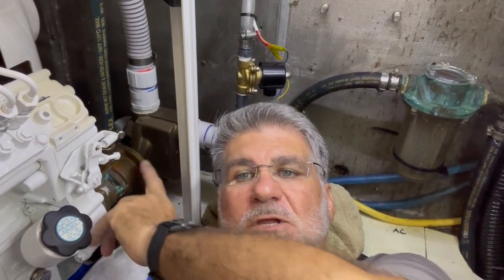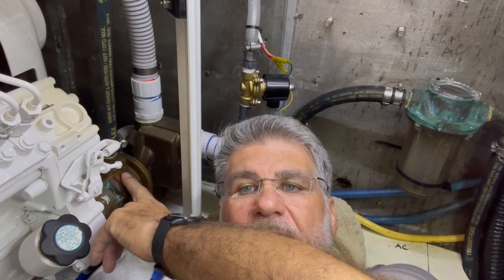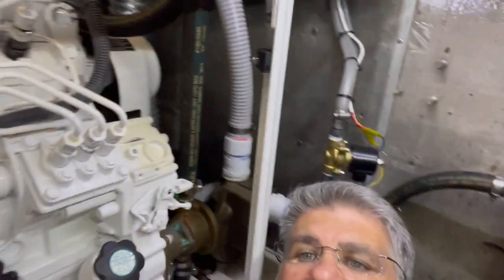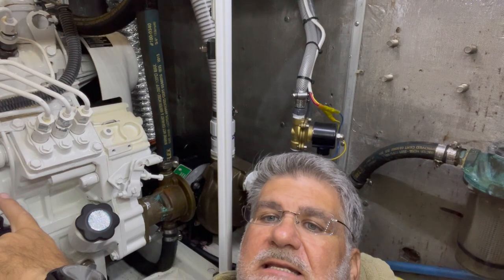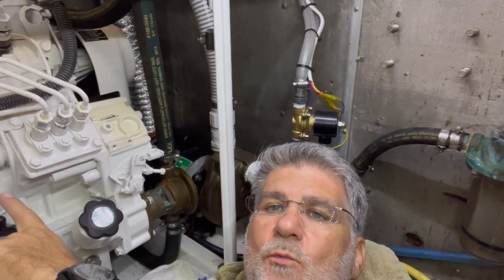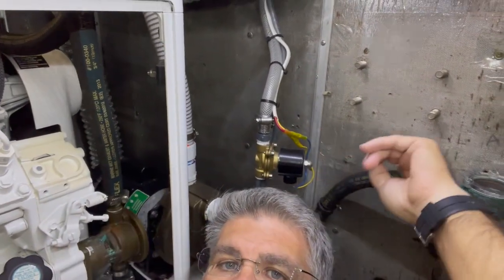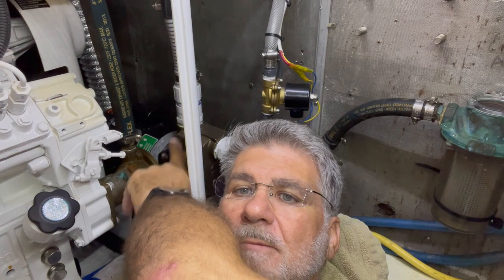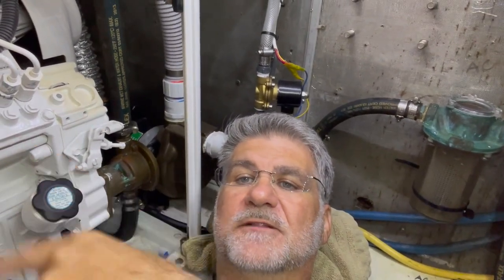In a previous video you saw me rebuild one of the ones I had as a spare, and I wanted to make a note about those spare pumps. The reason I had so many is this is a newer generator — I installed it in 2018, but from 1989 when the boat was new until it was replaced in 2018, the old generator's pump was so close to the bulkhead that there wasn't enough room to get a tool in to pull the impeller. So every time I needed to change the impeller, I just changed the pump. I kept two pumps and kept flipping them out. That's one of the reasons why I have so many.